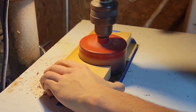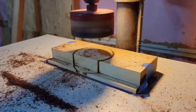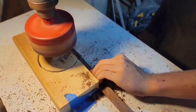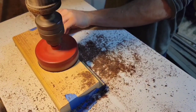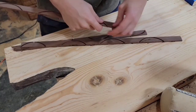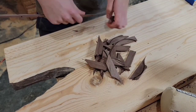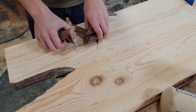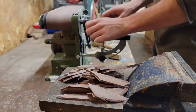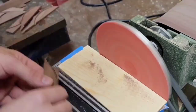This next part is going to be a little bit weird. I want to bow tie joint that live edge crack together, so I'm going to use a biscuit joiner to make some fake bow ties to put together the fake live edge crack I just made. I'm cutting a bunch of splines that can fit into the kerf of a biscuit joiner using a 4-inch hole saw bit and a jig. I don't cut all the way through — instead I cut just shy of the way through, then break them apart and clean them up with the disc sander. Making biscuit joiner biscuits like this is not my original idea — I stole this from John Heiss, so I'll put a link to his video.